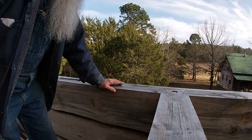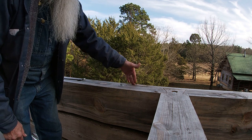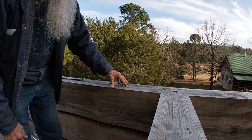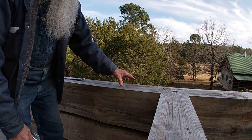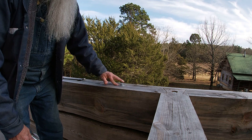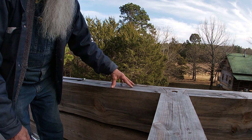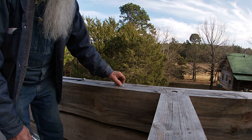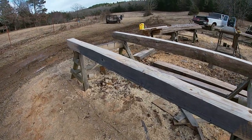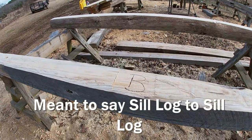I'll leave access to this even after the roof is on — there won't be a rafter layout here, so I don't have to worry about that. That's one reason I scooted it out 10 inches, to be sure and miss anything in the roof system. As this top plate and all the logs below it begin to settle, I can tighten this up and keep them snug together.